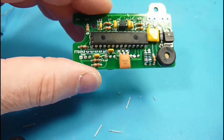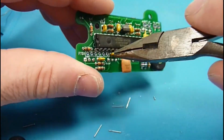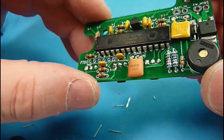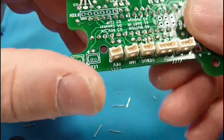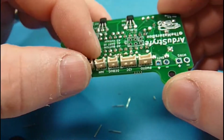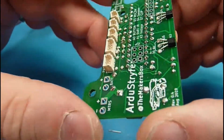by the screws that were used for that wire cover. And what I'll do, after I finish it, because I've been talking and been kind of distracted, is come back and examine each joint, make sure you don't have any bridges or missed solder connections. I don't know if you guys saw earlier where I had a capacitor fall out because I forgot to solder it in, but we got that fixed.